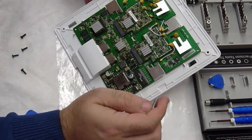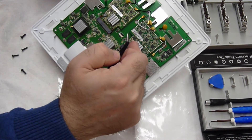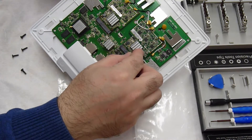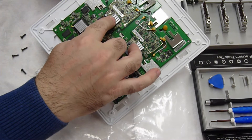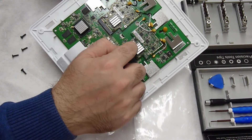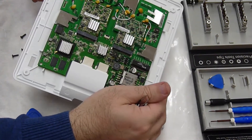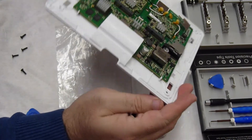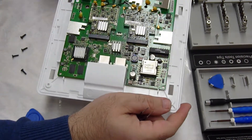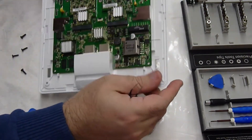It was a pretty strong UAP-AC. I think these use Broadcom chips — and that's why they switched these, because there was a compliance issue with their software or whatever. So they locked the features on these, the ones that are working. The newer Atheros chips in the AC Pros are much more capable than these old Broadcom chips, but these are working just fine serving clients. I have a ton of these out in the field still — as a matter of fact, last night I had to reset one, defaulted it, and readopted it.